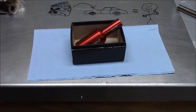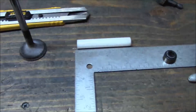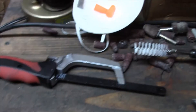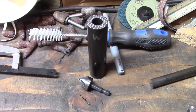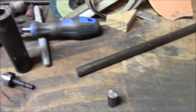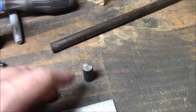Let's head out to the workshop and get started. In case you haven't figured out how I'm going to make this tool, let me show you what I've done so far. I've hacked off about a 3 inch section of the Delrin tube — just used my little handsaw and a razor knife to clean up the ends. I've chamfered the ends of the steel tube because it's pretty much already the dimensions I need. And I cut off a bit of the steel rod, but it's actually a little too short — I'll get to that in a second.